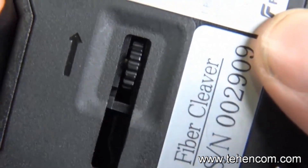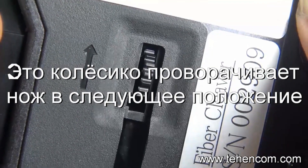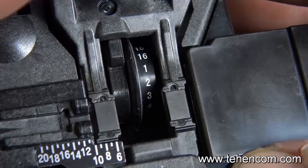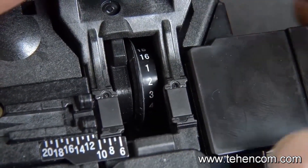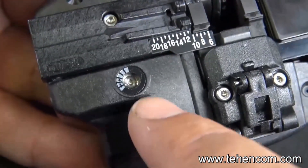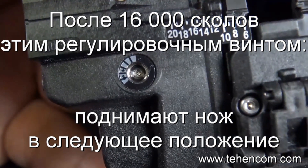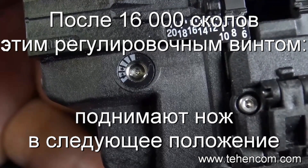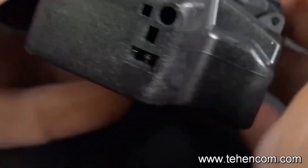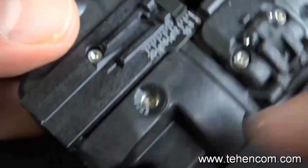On the bottom, once you wanna move it to the next number, go ahead and turn that wheel and it'll move it to the next slot. You wanna keep rotating that until you go around once. And it's easy to see the numbers. Compare the old one, the CT06 — there's a very small little dot internally on the inside there. You wanna move it to the next line using the wrench: stick it in the side and move it just enough to rotate that little dot to the next line. That moves the blade up once and you go around the wheel one more time.